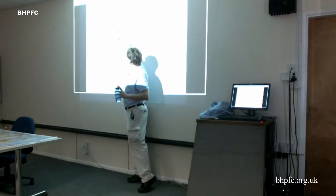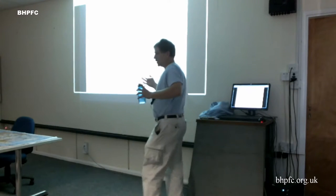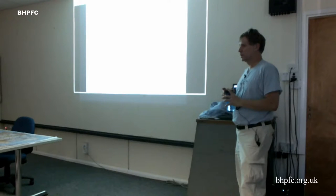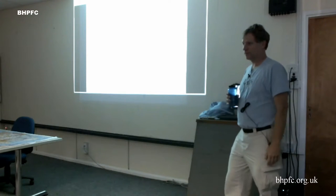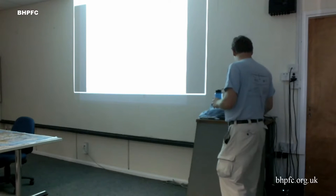We were going for a 36.3 kilogram airplane weight, and we finally got everything all added together. All but the last couple hundred grams of the plane are built now, and it's about 44.5 kilograms, so about 99 pounds. So we're over by about 20%. It's interesting. We had lunch with the AeroVelo guys that did the human-powered helicopter, won the Sikorsky Prize, and they said on Snowbird and on the helicopter, their professor had said, you always want to build in a 20% or 25% weight overage, and that's kind of what we came in at.